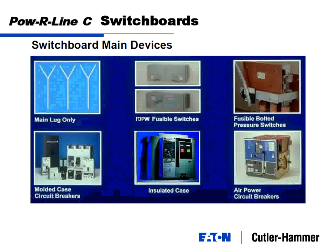Your most common applications of an air power circuit breaker, if you think about a data center, or a utility where you can have a big wall of lights and push buttons, and you say, okay, you're looking at your power, and we're drawing too much over here, let's shift some load over to here. So you can hit a couple of buttons, whether it's a computer, a PLC, or some manual button you're pushing. And boom, you can open a circuit breaker in the equipment room on that side of the building. You can close the circuit breaker in the equipment room on that side. And be able to do that basically by sitting at a control panel or looking at your PC.